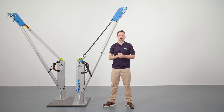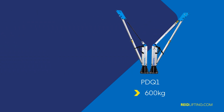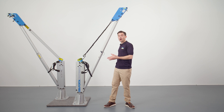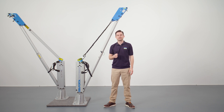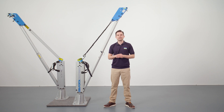You can find more information in our product brochure, which can be downloaded from our website. Both product variants are available in two sizes, the PDQ-1 and the PDQ-2. The difference between the two models is a variation in the radius length and increase of height offered. The PDQ-1 provides a maximum radius of 1,200mm and a maximum height of lift of 2,111mm. The PDQ-2 provides a maximum radius of 1,500mm and a maximum height of lift of 1,957mm. At 1,500mm radius, the working load limit is reduced to 500kg.